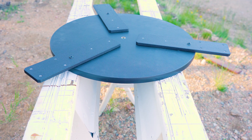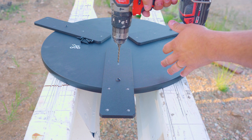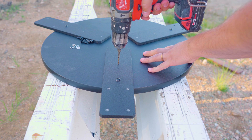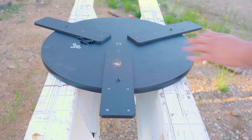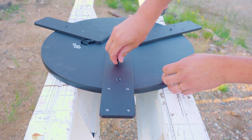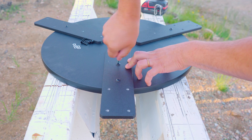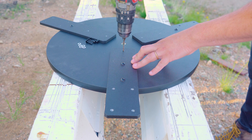Now position the board to prepare for drilling. I have the ground board positioned over the sawhorses so I can use the mounting bars as guides to drill the holes. Drill a hole using the included 1/8th drill bit and insert a screw and washer as you did with the first hole. Follow this procedure until all of the mounting boards are fully installed.